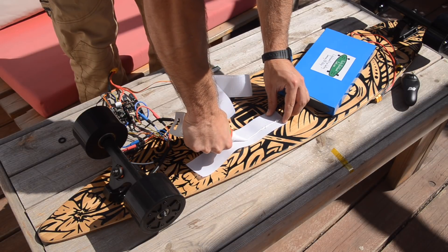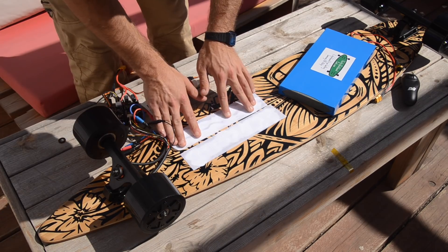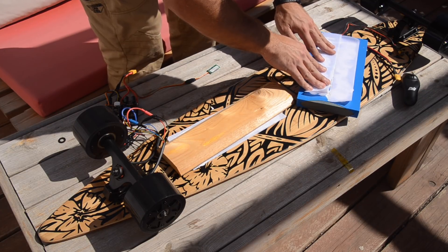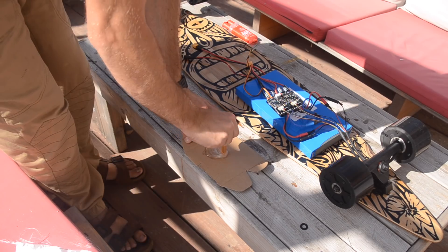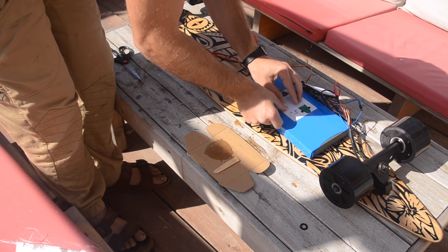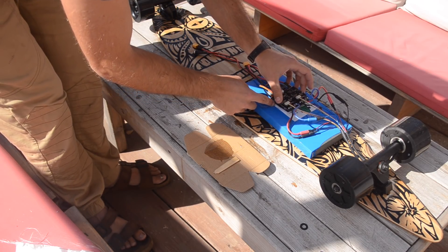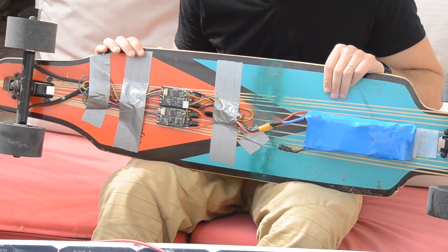There are many ways to hold your components to the board, but I'm going to use some industrial glue to put down some velcro which will hold my battery onto the bottom of my board. I'll use something heavy to hold the velcro down while it's drying, then do the same to the battery using the other side of the velcro. I'll also use velcro to hold the dual ESC to the battery, but I'll use some epoxy for this since the controller isn't as heavy. You could leave your board like this once the glue and epoxy dry — this board is fully functional, and I've ridden other boards like this for months with the components simply velcroed on and the wires taped down.